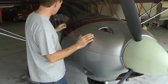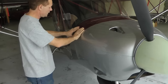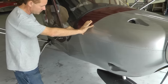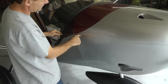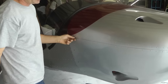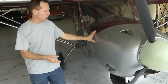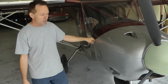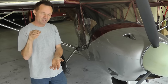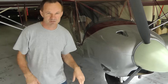When putting it back together you will develop a method. Part of what you want to make sure of is that at the ends here, you cut away a little bit of cowling so that you can see the first hinge loop, and then give it a couple of taps as you put the pin in — it goes in pretty easy. You shouldn't feel like you're cheating by putting a thinner pin in, because these aren't just hinges. All those little loops are actually holding the cowling together. It's like having 50 screws — it's very, very strong.